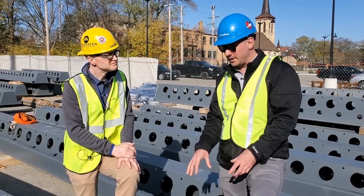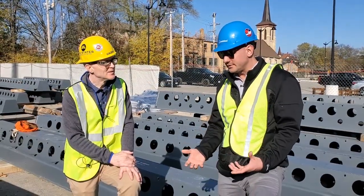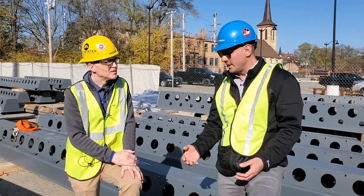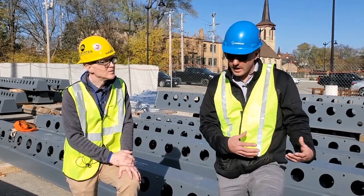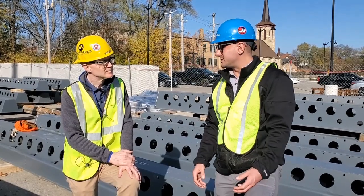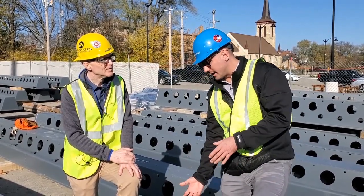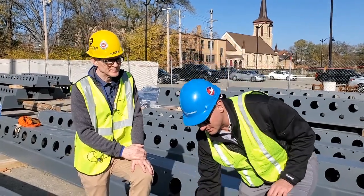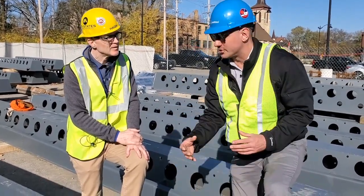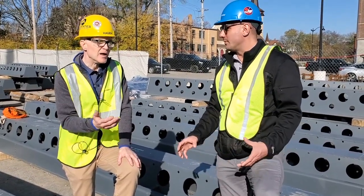The concrete design in the interior is where the fire rating comes from. There are UL listings for one through four hours, and really the main difference between a one-hour rated beam and a two, three, or four-hour rating is the amount of reinforcement in the interior section to offset the loss of capacity under fire as the bottom section heats up. But this top concrete section is still considered at full strength, so the lower section needs the additional support from the rebar.